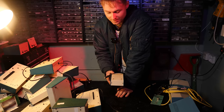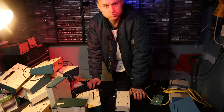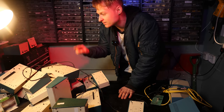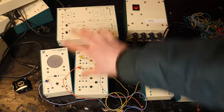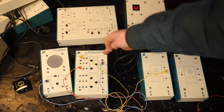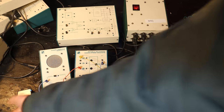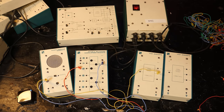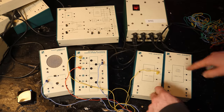If you haven't guessed already, the reason these are still in the box is that this is RF test equipment. The VCOs run at 1.28 megahertz, which is way beyond what we can hear — we can only hear up to about 17–18 kilohertz. Way beyond even dog hearing. The solution I found was using the heterodyne principle — the beat frequency. Two oscillators beating off each other. So this is the first setup: power supply, two VCOs, the double balanced modulator, and an audio speaker module. A mic will hopefully pick up what comes out.